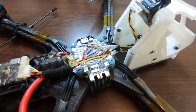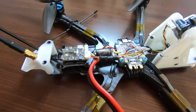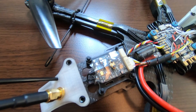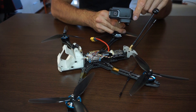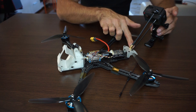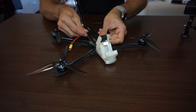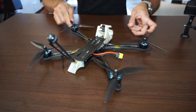There's really ample room on the frame to accommodate everything. The FPV cam goes to the front above the GoPro, then there's ample room for the stack — the FC and ESC. Since the frame has a 30 by 30 mount at the back, I used the supply bracket that came with the FC to mount everything and give the VTX some room to dissipate heat. The only thing lacking is the GPS module that I don't have right now. So this is the complete build and the only thing left to do is take it for a spin.